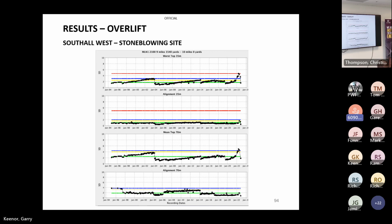So we generally use DTS overlift, and it's really good under overhead line, because if we're lifting 25 mil, we know, and we're calculating, we're settling at 10 mil on the DTS only. So I don't know if I should be saying this, but we're doing overlift under overhead line, and technically we're lifting the track, you know, 30, 35 mil, but the DTS is coming around and settling it well below our mandated 25 mil.